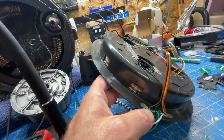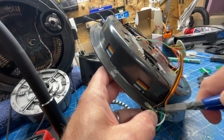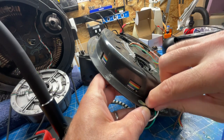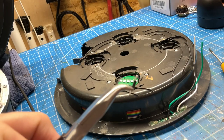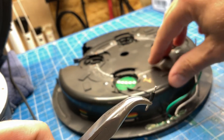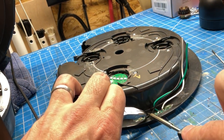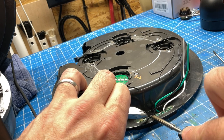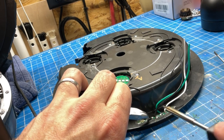I am going to take the chance here and snip my black wire off this ground. I'm going to snip this one off that second ground. And what I'll do is get a small piece of wire and just jumper between those two. I've made a tiny little jumper and I am going to attach that down here.